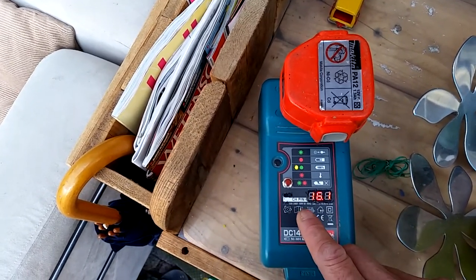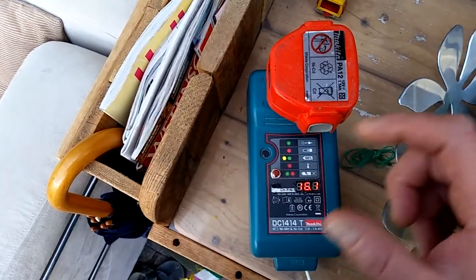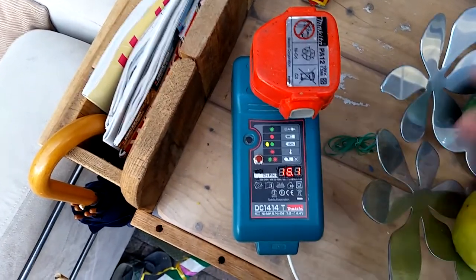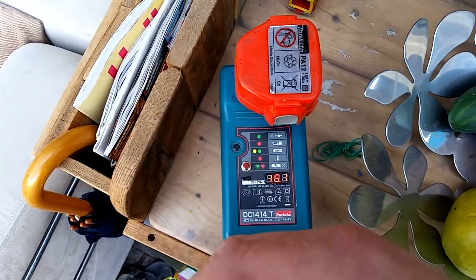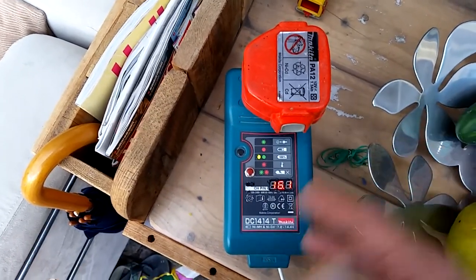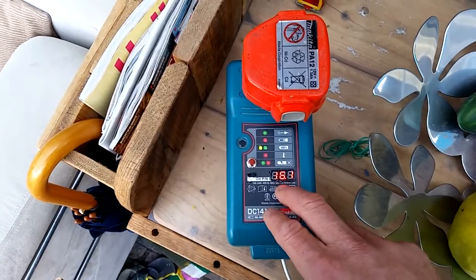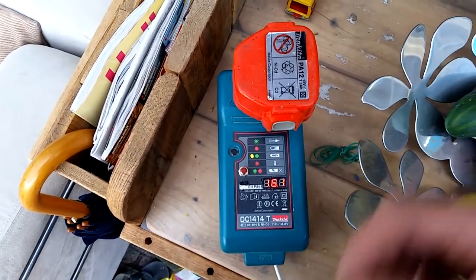What I'm planning to do is make a circuit board out of this schematic. I can make a complete circuit board with all components in place, the coil wired, everything done for people who like to build stuff themselves but don't want to put all the effort into the electronics part — just have the charger ready to go. I'll also probably give an option to use different voltages depending on how many lithium-ion cells you want to use, or any other cell type. You can also use it with lead acid batteries — you only need to change the maximum charging voltage, and that's really easy to adjust in the circuit I designed. It's all solid state, so no potentiometers that can change values — it's all fixed with components. It just works.